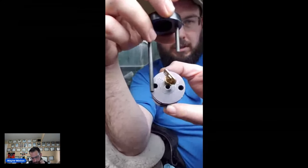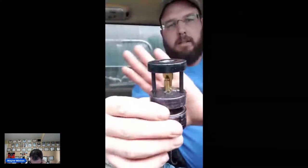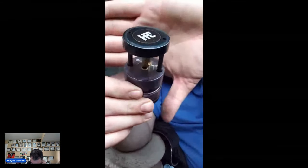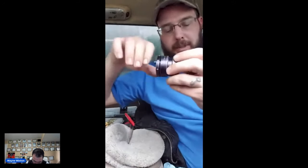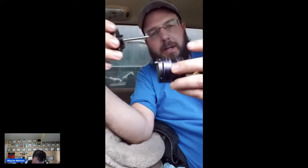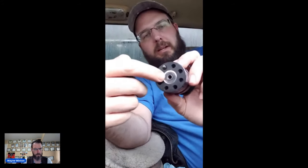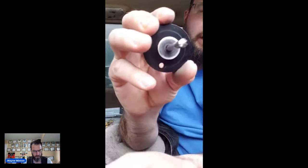There's 2 holes. There's a post and another post, a long post and a short post. They only go one way. Okay. Only go one way, and that's going to lock the wheel, the depth wheel, from turning. Now I can no longer turn this, okay? So I can't lose position on it. That thread depth then stops this. The way this works is this cutter goes into here, it slides up through the hole, and it cuts the key. This is your measuring factor based off of rotation and depth. This, you can see, rubs right onto here. Where it rubs on there, that's how it stops it. Okay? This stops right there. That's how this system works.